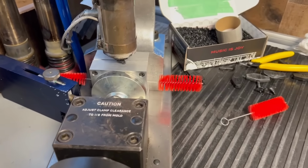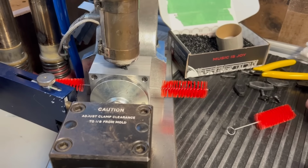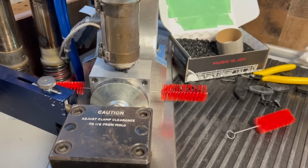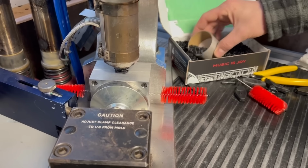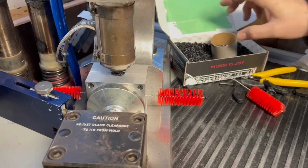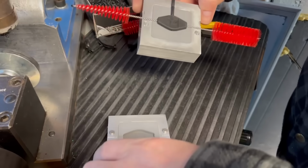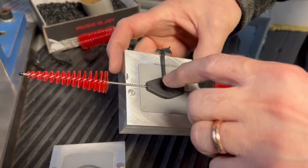So we've brought down our inject time, keeping everything the same. Nothing leaking out, or not very much. Yeah, just a little bit, but that's good. With it leaking out there and not flashing, that's a good sign. Probably just sanded down the flash issues. Yeah, that'd be a perfectly usable part for a lot of folks, even though we're having weird fold.